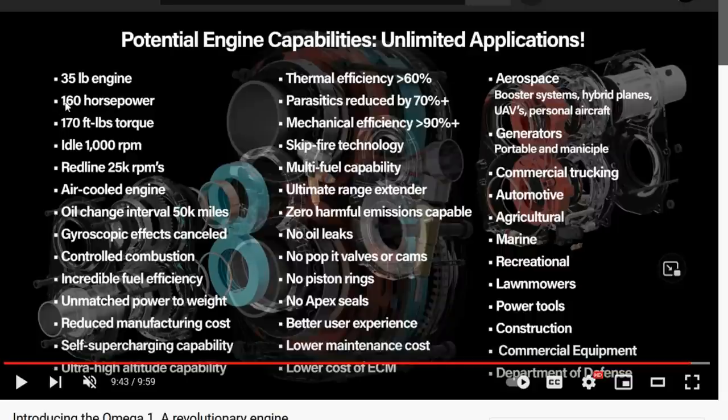But if you've got torque, right? You've got torque. You've got the horsepower output. You can actually work out by doing torque times RPM divided by 5252. You can rearrange the whole numbers and you can get what RPM that is at. Now, with this amount of torque, at this horsepower, the RPM is 5,000.